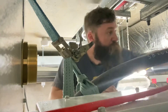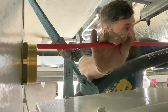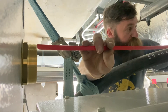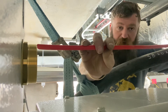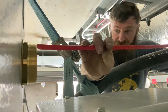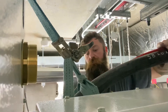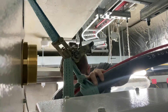So what I'm doing now is using this as a measure, as a template. It goes on top of the cable as it comes around the corner where the ratchet strap was, and it comes in a straight line - it avoids the smaller cables and then goes on to the gland at the top. That's where the armouring is going to be set. When I strip it all back, they'll be touching that little bit there where the red's touching. So now if I transfer this over here, run it along the top of the cable, I can make my mark on there.